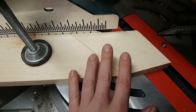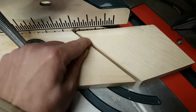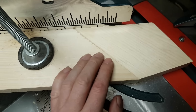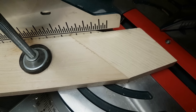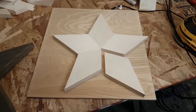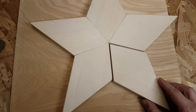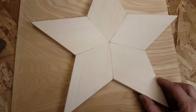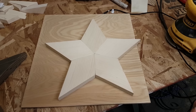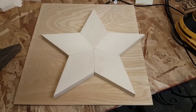Before I start cutting, one more reason why the angles can be off: sometimes you just get a little wood chip stuck between the piece and the fence and you might not notice it — that's enough to throw everything off. So the recut went quite well; I only had to shave off about half a millimeter and the final piece slides in very nicely — much better than before. That's a pro tip: I wouldn't want you to cut a whole bunch and find out they don't quite fit, because it can be very annoying when your angles don't fit.